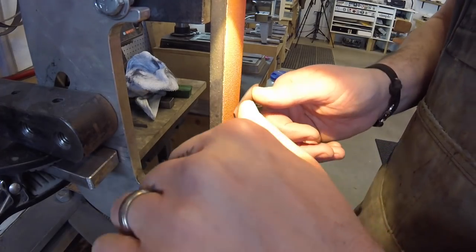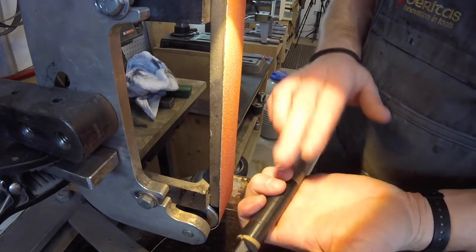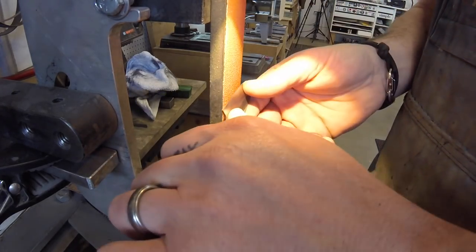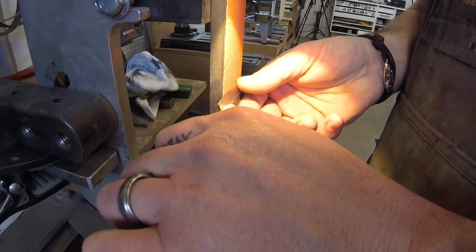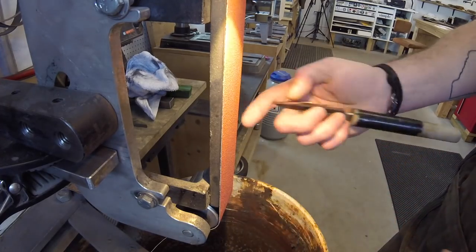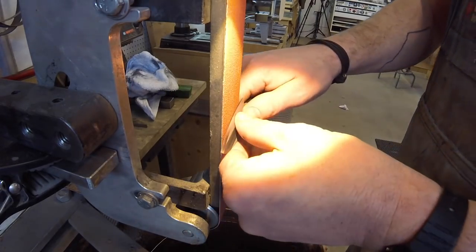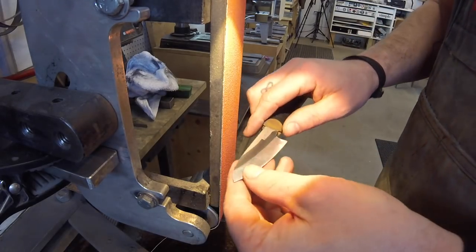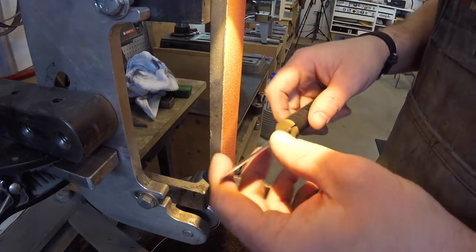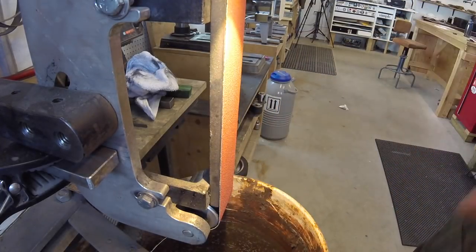So I'm pressing with both thumbs, getting a general sense, but then I'm locking it in with my left hand, with this little wrapped grip, wrapping my fingers around it. If I need to grow that angle, I can come in, find my datum, and just articulate the knife like that. So this little handle is just the game changer for me when I'm doing little kitchen blades. You're gonna sacrifice some skin on your fingers, that's how it is, but just think about the roll. Coming in here, find that, and we can roll where we need it to go. This is 100 grit ceramic, that's what I'm doing my rough grinds with. We'll probably jump to Trizact, and I might even take this to the disc grinder to flatten it all out when we're done. But this one's going to be a very, very thin grind at the edge, so let's keep at it.